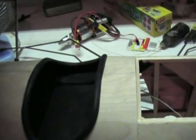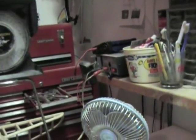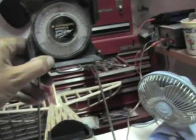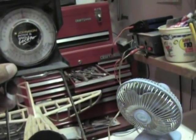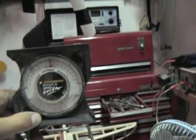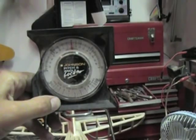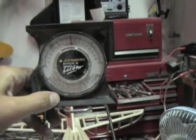I'm going to feed that into my holes. When I push it down, I'm going to come up here and figure out where this angle is. Now since I was your guinea pig — this is the rule of thumb for the three-blader; the four-blader might be different and might have more drag — I want this to read about four degrees. So I'm going to have to shorten this just a tad, doing a little bit at a time until that reads about four degrees.